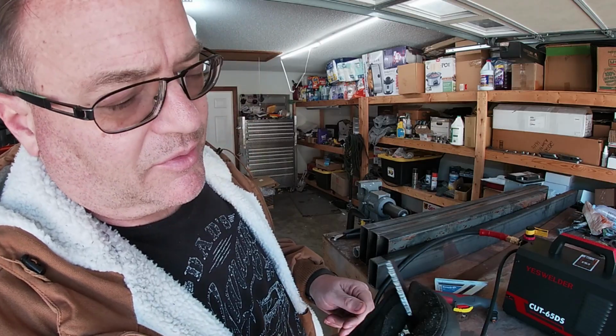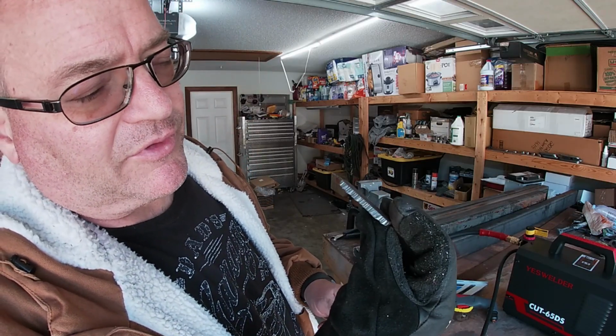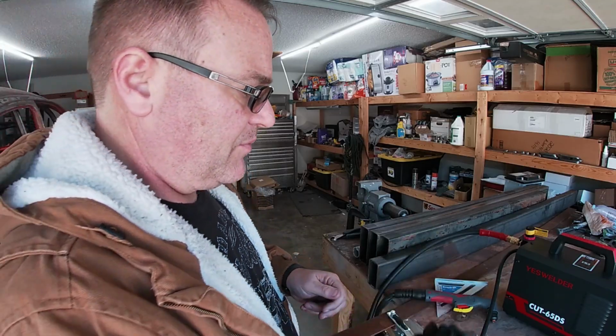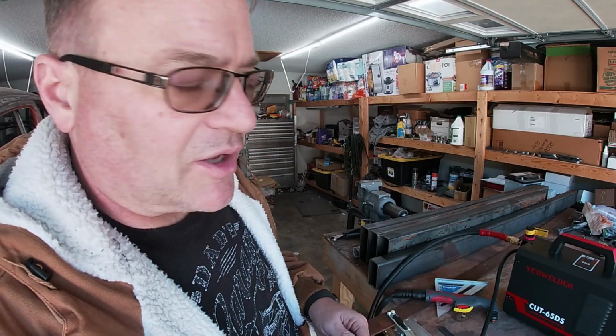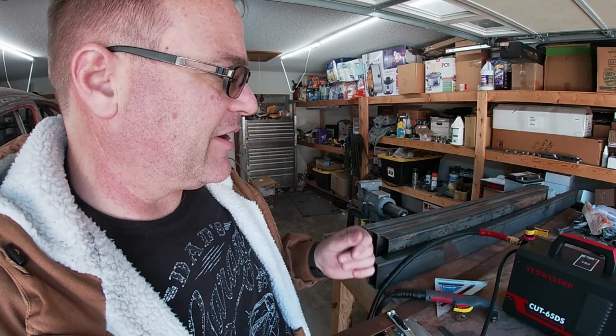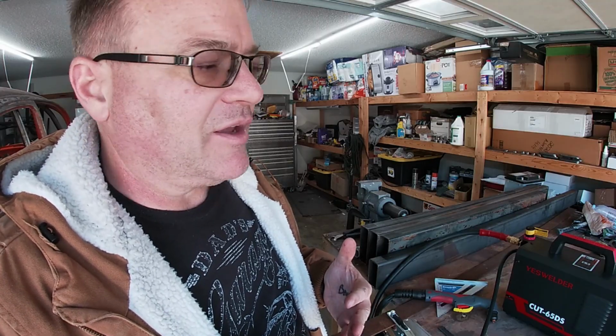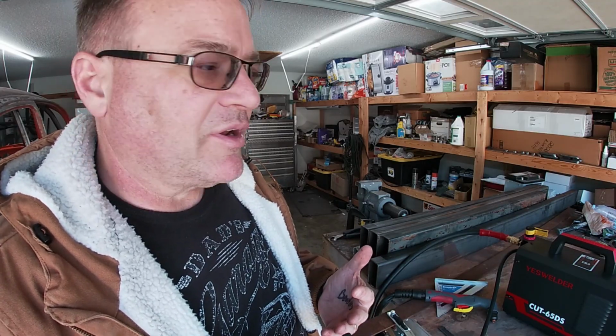And whew, there we go. That's the 40 amp side. Much better, much less slag, hot even through the glove. But I bet you anything, if I were to pump up the air pressure a little bit more, it says for 110 use 60 psi. I'm going to test that out. But anyway, yeah, so far so good.